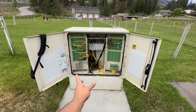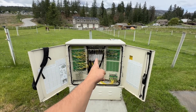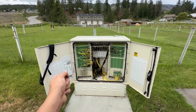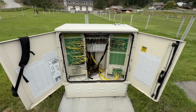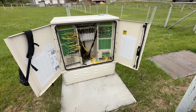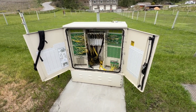You have your distribution either side, you build that out, and then you have your feed that comes in. And you use splitters to turn one fiber into 32 legs, and patch that light into whatever distribution port you're looking to connect out in the field there. Alright guys, so it was just a quick video explaining the FDHs and how they function, how they work. I hope you guys enjoyed — don't forget to hit that subscribe button. We'll see you in the next one.